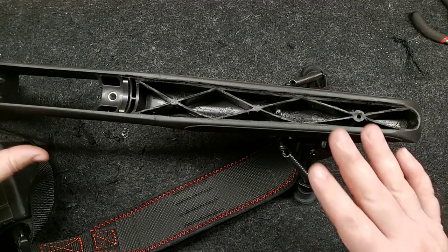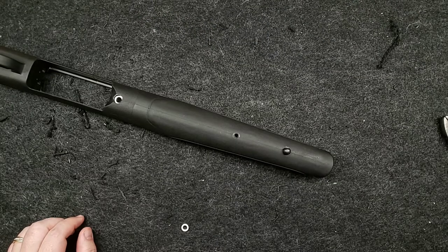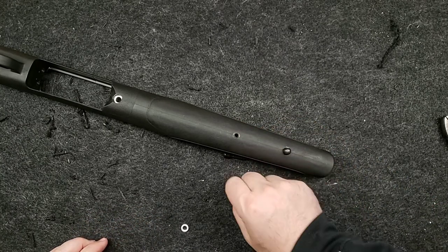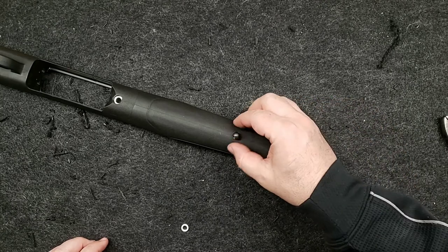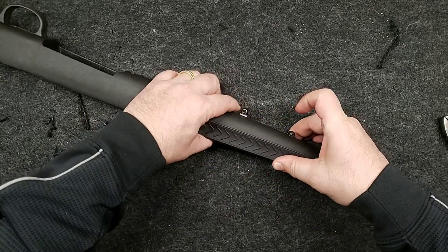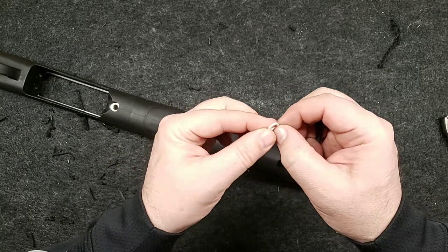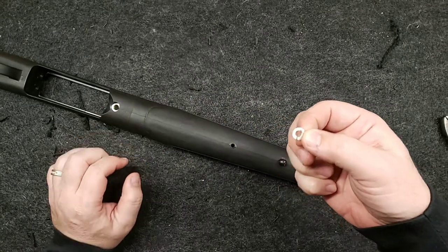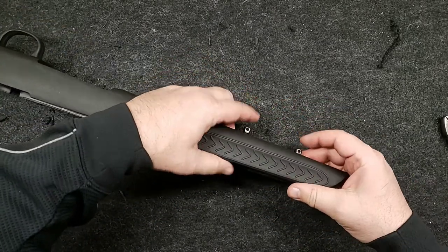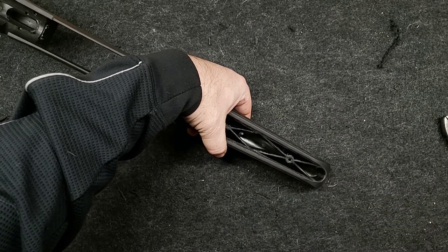That's cleaned up pretty well. I'm going to blow this out with the air compressor. Before we put this thing together, I wanted to do a quick update. Remember we had added an additional sling stud in this location — I used a washer in between the sling stud and the body. Well, I didn't really like that washer there, and as I took it off I realized it was actually cracked now. So it's a good thing we took that off. I'm just going to remove that washer altogether and mount it like the other one. Just a quick update — we'll put this together and get started on stiffening this thing up.